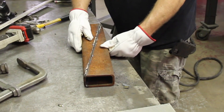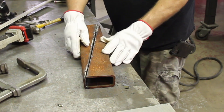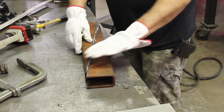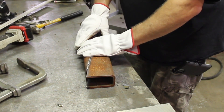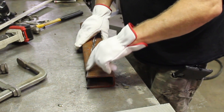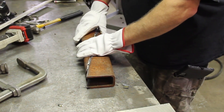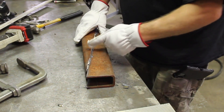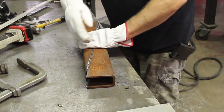The cut is done — we just need to clean up the edges a bit. You can see the four-inch tube and how sliding it down lets us adjust and compensate for virtually any inside dimension. We'll trim the small flat off, put it in the frame, figure out exactly where it needs to be, and then put a line across it so we can see the position before pulling it back out and trimming.